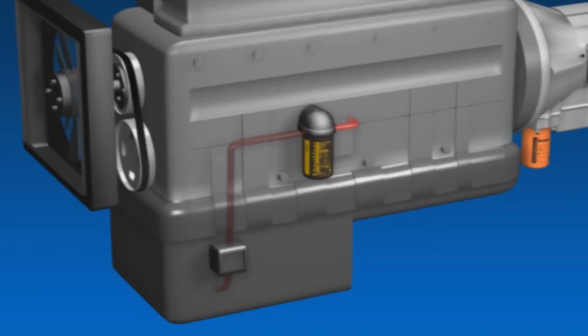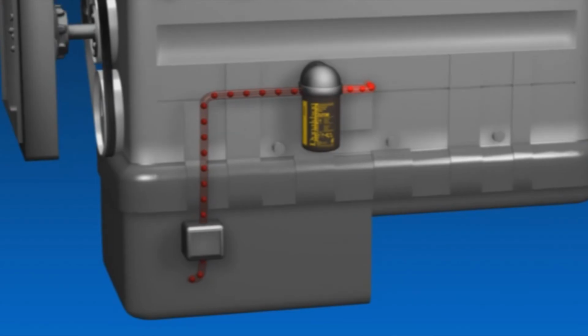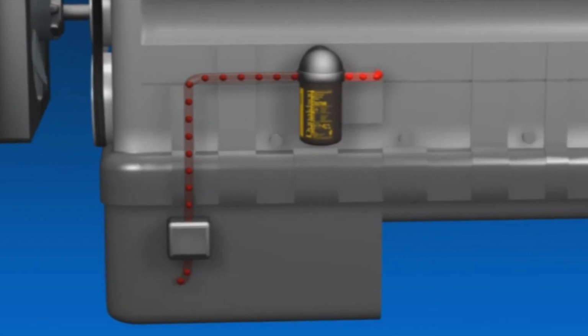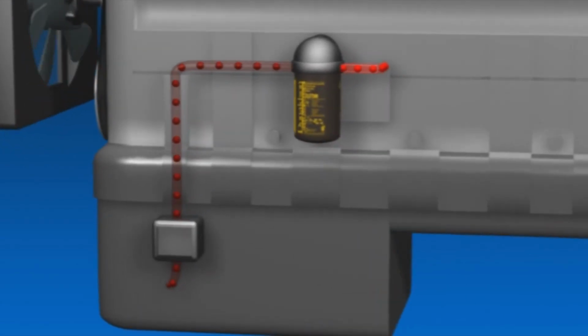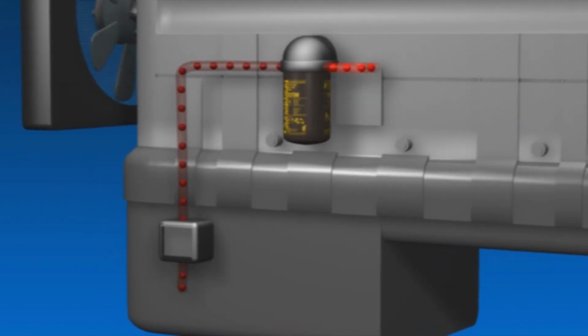Here is a photo of a filter doming because of excessive pressure built up in the lube circuit. Unnaturally high lube system pressures have inverted this tap plate, and this filter has developed a vertical crack indicating pressure fatigue. If you should notice any of these telltale signs of excessive pressure in the diesel engine lube circuit, it will be your opportunity to solve developing problems before additional damage is caused.